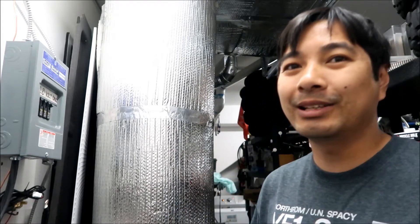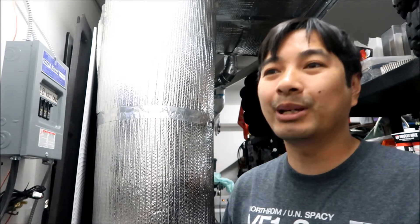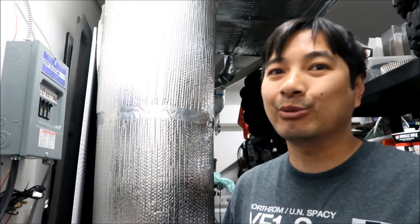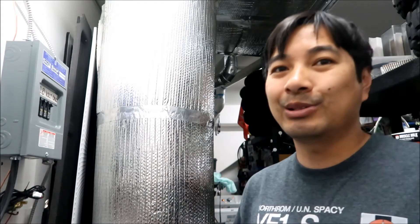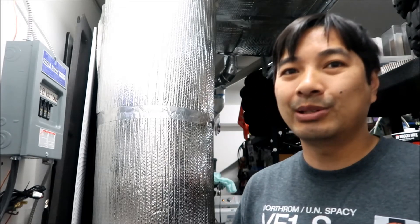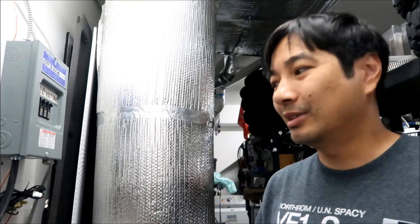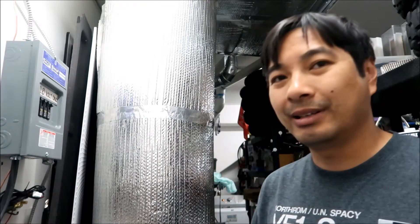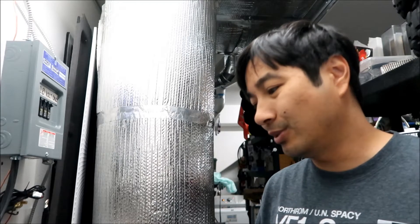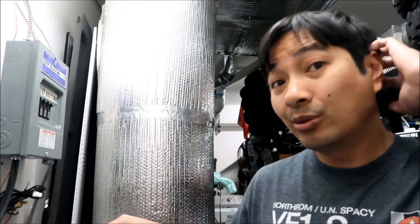This is very frustrating but it was working great for a whole month. I charged my bike yesterday and knew the battery bank was low, but I figured it would just switch over to grid power like it's designed to do. I think we're going to have to replace that one cell - what a headache. We'll see if we can wake the BMS up - there should be 22 volts coming out since the whole pack voltage is 22 volts.